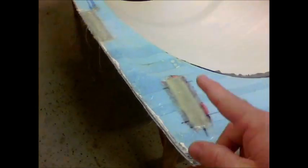I'm getting close to glassing the inside of the canopy, but one thing concerns me: when I put the foam on here, there's not much clearance between this and the longeron - not enough room to put a decent thickness gasket or seal. After this is glassed, it will sit on top of the longerons when it closes. I think the best option before glassing is to remove three-eighths of an inch where the canopy rests on the longerons on both sides.